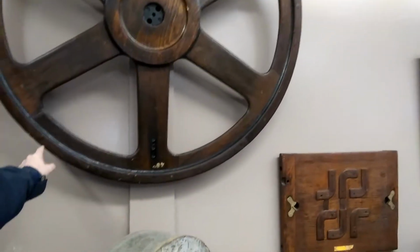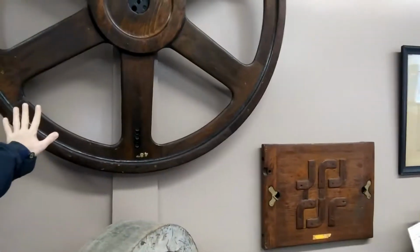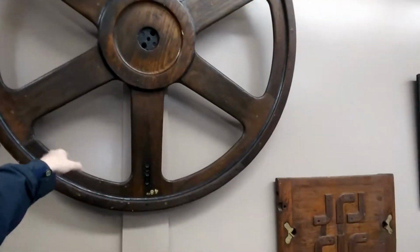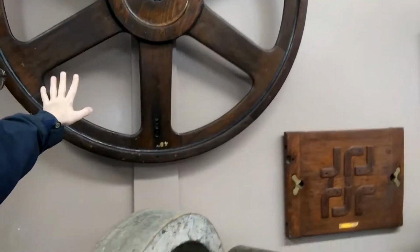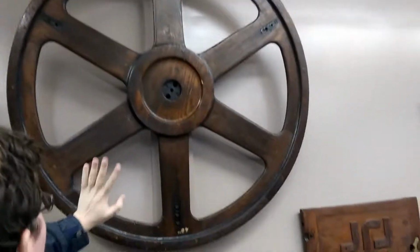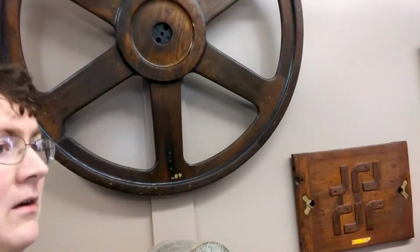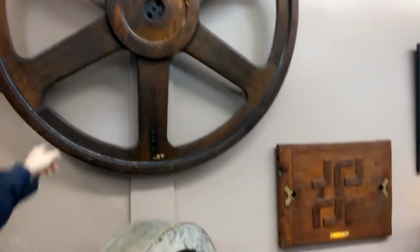Yeah, so this would be a wooden pattern. This is what they do: they put this in sand, and then close the box. Put it halfway in sand, probably put some releasing powder like talcum powder on, and put another box over it, and then put in more sand. Lift it up, take this out, leave a hollow hole, and then dump liquid metal in there, and the metal would come out with that shape.